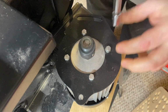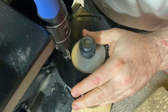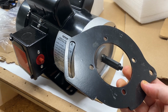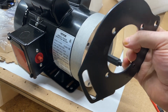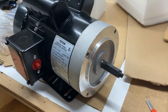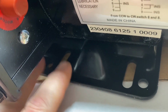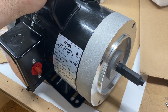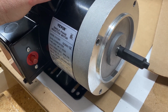Okay, these are 10mm. Okay, so this is the tensioning system on the smaller motor. The entire motor is mounted to this, and this thing pivots around this point here, with this track being for tensioning. This bigger motor, I think, would only work if I'm using this base at the bottom to have it rest on the stand. And you can see it's got slots here. And I think those slots would be how I would tension this one. This entire motor could be shifted along this axis, along the top of the stand. So I think that has good potential to work.